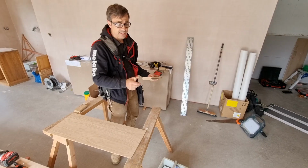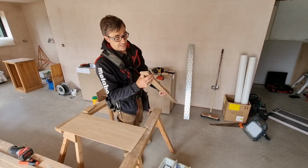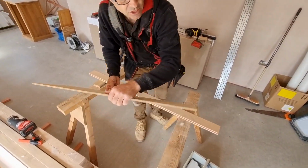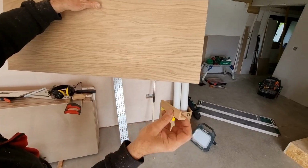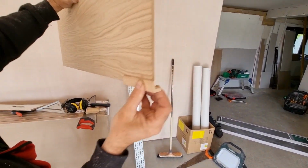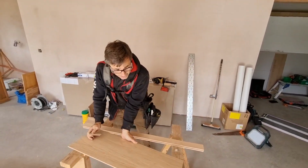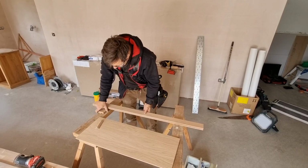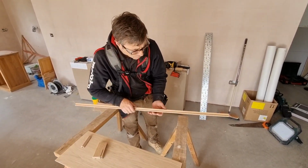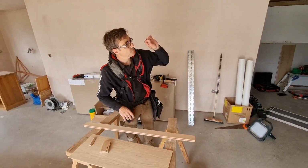Then there's a nosing section which is exactly the same as the treads on the staircase. To cap it at the bottom, there is a small bead, which is like this, which will take you around to the ceiling, something like this. So we're going to go and pop that in. Now what I've obviously done differently is adapt our nosing to pick up our floor. So I've put a rebate. Let's go upstairs and I'll show you exactly what we've done.